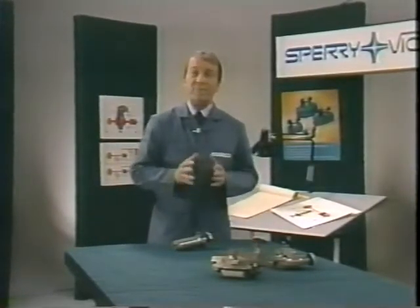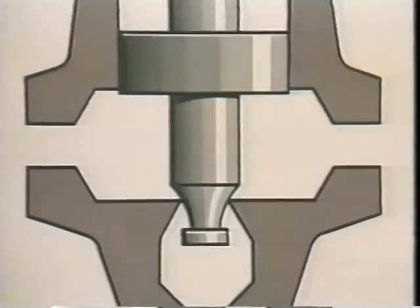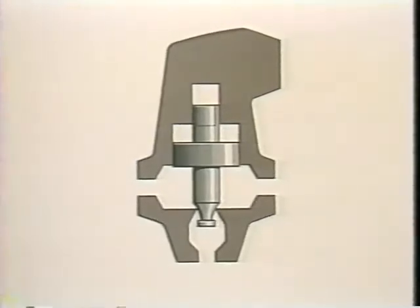Fortunately, there are better valves for handling large quantities of oil. They have a number of different names. We call ours a balanced piston relief valve, for reasons that will become obvious if we look at an illustration. We start with a piston which has equal areas on the top and bottom. It fits into a body which has a straight-through passage for convenience in piping, and a port at the bottom which must be open to tank. If our pump were on the left, oil would flow into the valve around the bottom of the piston and out the other side to the cylinder. Even a light load on the cylinder would cause sufficient pressure on the underside of the piston to lift it off its seat and permit all the oil to go to tank.